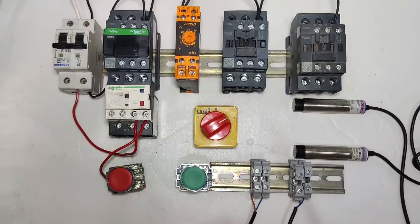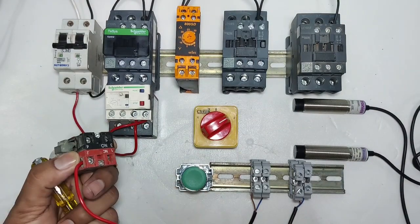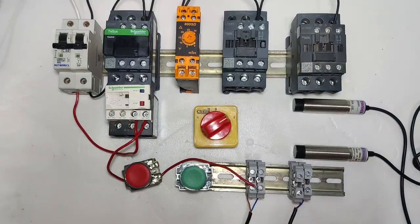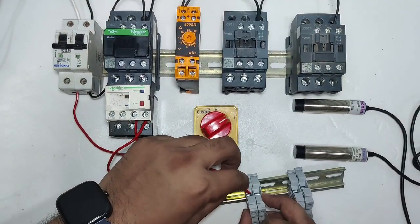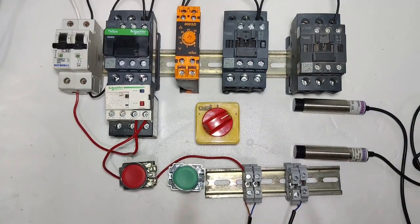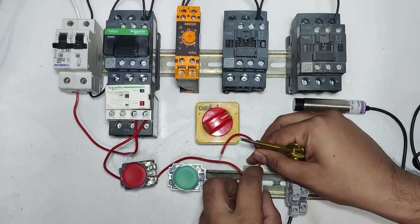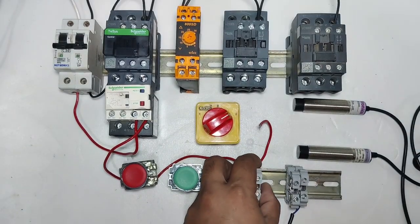Okay, now NC push button output, we connect one connector. Okay, and connect this connector to stop sensor, NC sensor input terminal in which red wire. Okay, in normal condition supply passes with this blue wire. If sensor operates, so it will cut off.